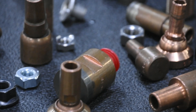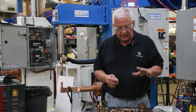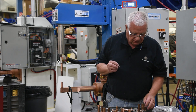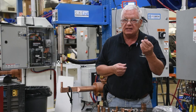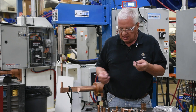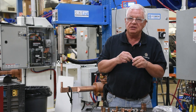We have a lot of different choices of electrodes that we can use to weld this projection stud. When we're looking at the choices of projection welding electrodes, we've got the bottom electrode and we've got a top electrode. We need to have an electrode that this stud can fit into, with a cutout in the electrode where this stud can sit. One of the things we have to look for is that this inner cutout needs to be insulated so that we do not shunt current from the threads of the stud into the electrode.